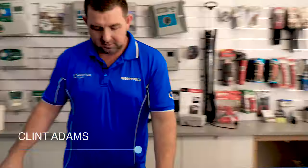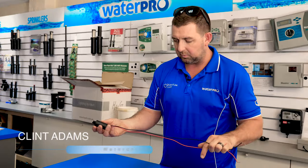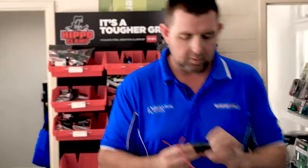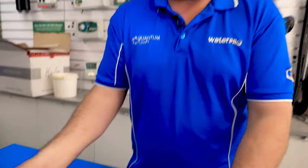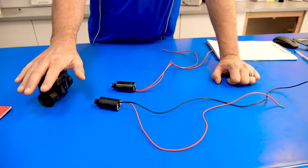There are a few things that can go wrong with a solenoid valve. This is a DC solenoid valve — direct current. You'll notice there are two different coloured cables, which signifies it can only be wired one way. They're used for battery operation. That's the valve that comes with the Hunter node. This is a coil which is an AC coil, and an AC coil can be wired any way around — that's why the cables are the same colour. That's the difference between an AC and a DC coil.